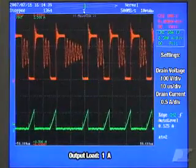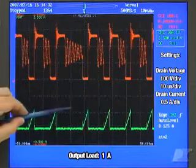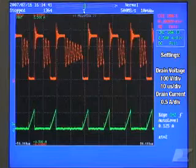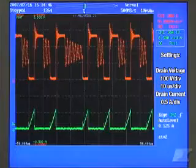I'll briefly stop the oscilloscope. You can see a series of switching waveforms, but notice here one has actually been skipped. This is how TinySwitch 3 maintains output regulation — by enabling or disabling switching cycles based on the load requirements on the output of the supply.